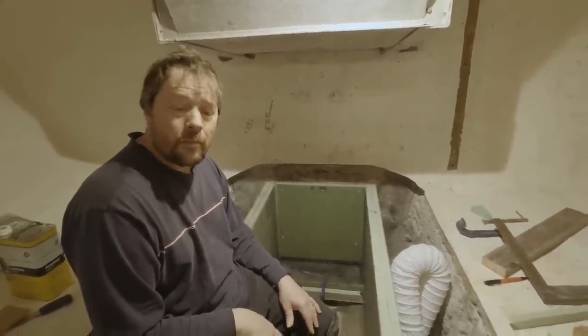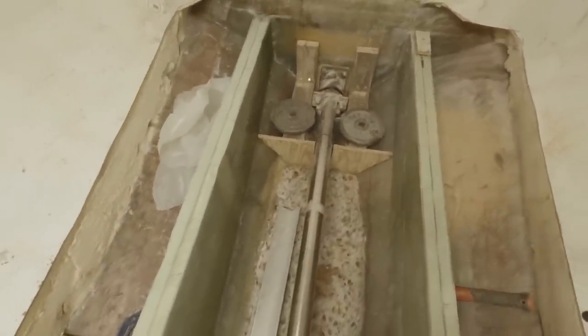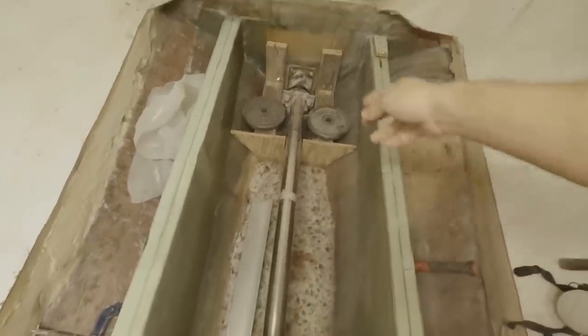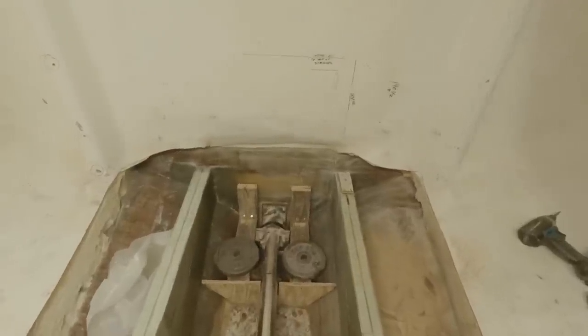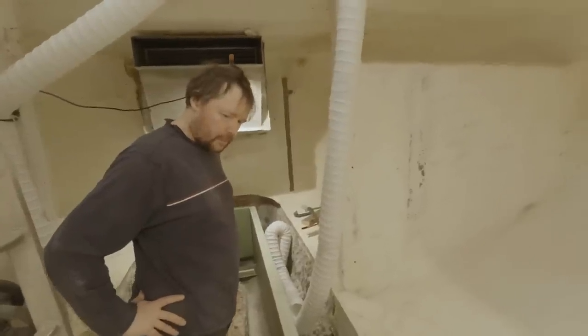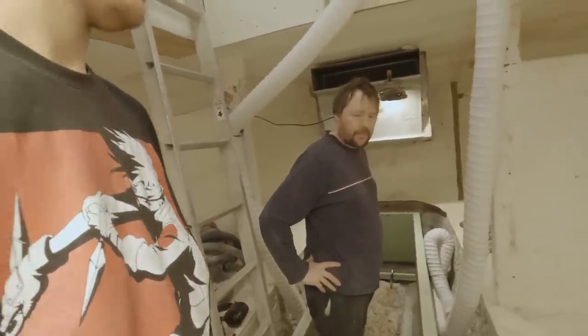It'll be really easy to pick back up where we left off. So here's Dad's Dam — the concrete form. This is where we're stopping for now with the concrete. Until we get the shaft out of the way and deal with that shaft log there, we're going to hold the concrete back, because it'll be a lot easier to get our glass under that packing gland fixed up once this is out of the way. The packing gland will be taken off, and then we can build up the glass and set it back in there. It's too cramped to try and work around that — you could do it, but it would just take a lot more time. And since we need to build it up underneath the packing anyway, it just makes sense to wait.